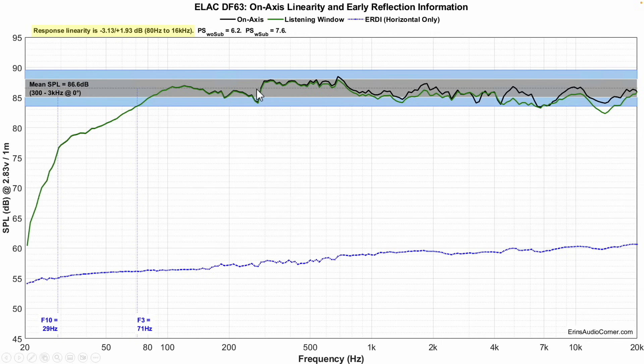This area around 200 to 300 Hz — this dip and then strong peak — is related to the resonance I talked about earlier, and it was audible to me. Going higher in frequency, the mid-range sticks up a little bit more — maybe about a decibel to a decibel and a half — compared to the upper mid-range and the overall tweeter level. The horizontal directivity is going up to about 2 kHz, and if you follow that trend, you can see what it would do if the speaker were perfect. However, around two and a half kHz it takes a different angle and flattens out a bit — I'll bring that back up in the horizontal contour plot.